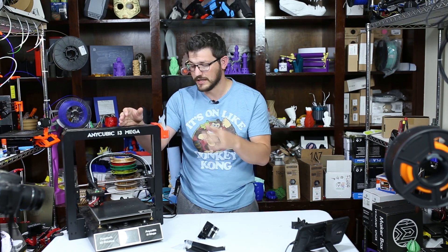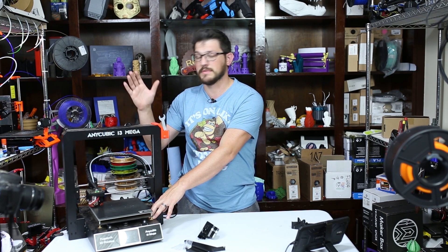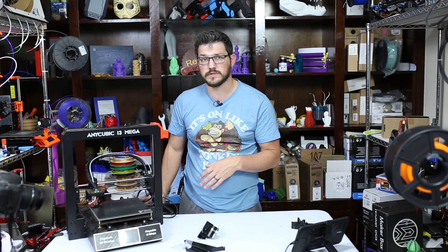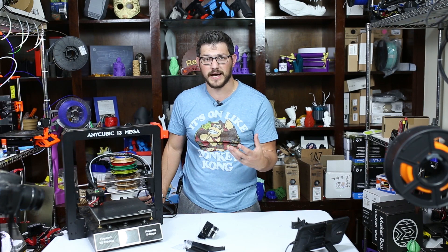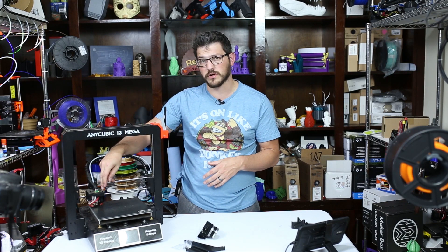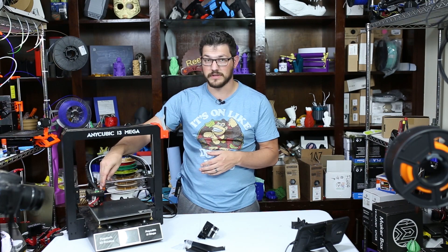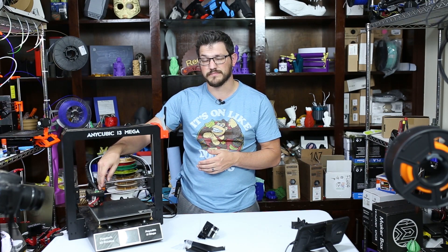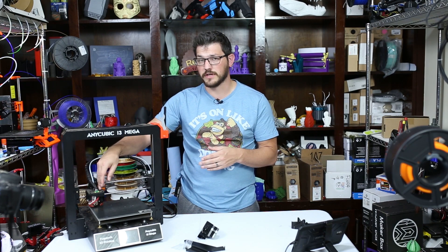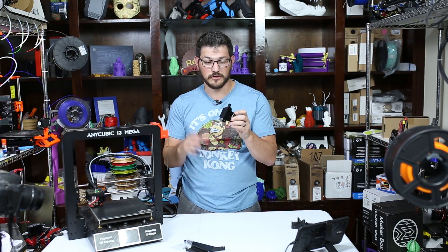This is an awesome machine. I've done some other upgrades to it — it's running TMC2208 drivers and that makes it so much quieter and smoother. I've also added a blower underneath for active cooling on the steppers because they do get hot. I've added LEDs, a tool holder, and a different part cooling fan. I'm going to do another video on the hot end upgrade separately.